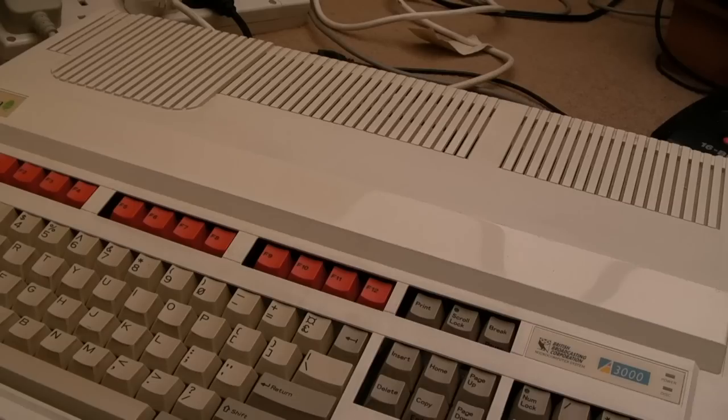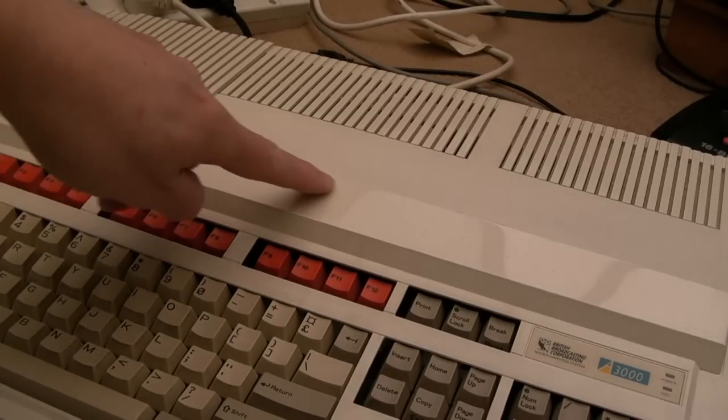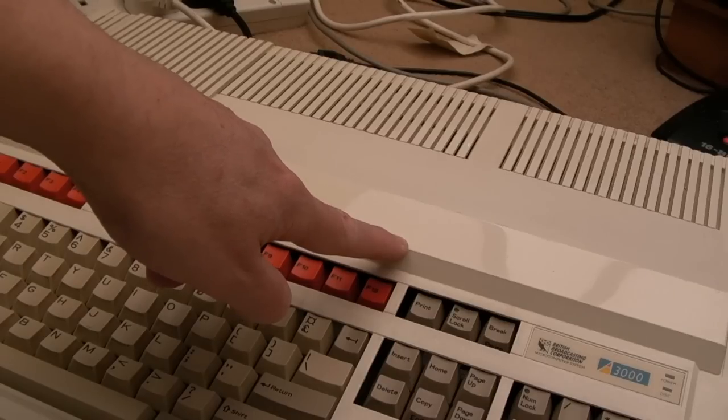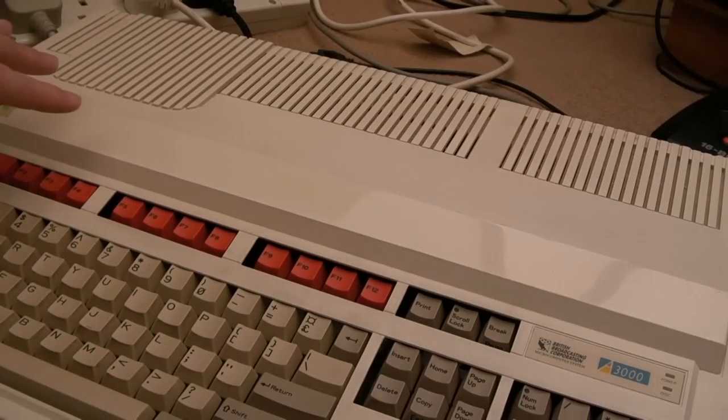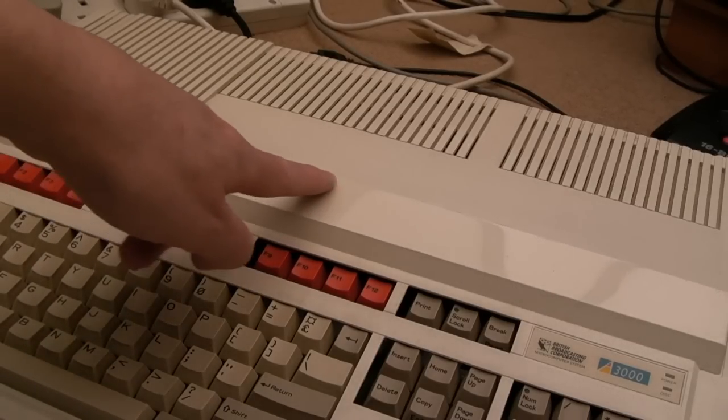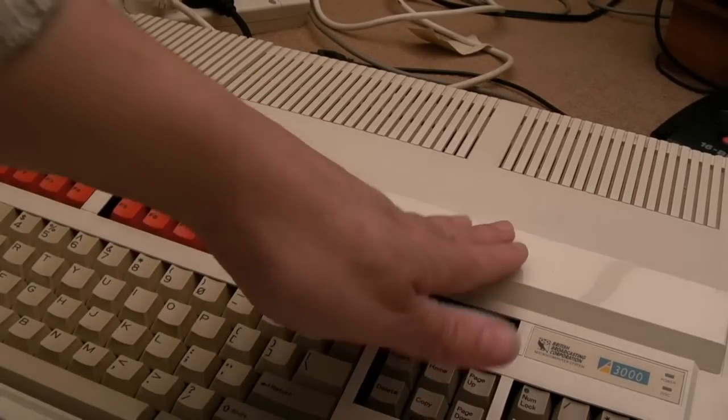You leave them out in an open room like this where there's lots of natural sunlight and stuff, and they start to de-yellow. So yeah, Retr0bright's not all about trying to resolve something where the sun has affected it. In some cases it's the exact opposite, and I think that is a good example. Where the label was on there, it's a little bit yellowed. Where the label wasn't, it's cream like it was originally, especially since this has been exposed to the sunlight in here all year. But that label has covered up that area there, and it's not glue.